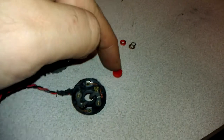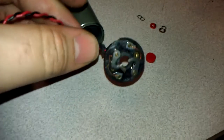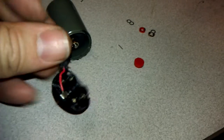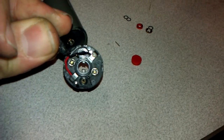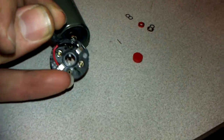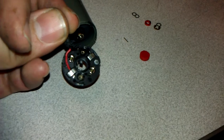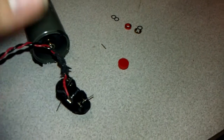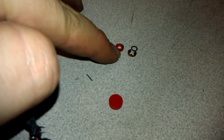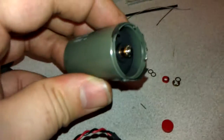Around the back, this red plug was pressed in after assembly. There is no bearing on the back of this motor, unlike a Mabuchi motor or whatever. There's a little access port where you can view what's going on when you're assembling it. I pinned the brushes back through the pinholes with a pair of resistor leads. From the front of the shaft, there are a couple of shims, an oil seal, and a little circlip. I suspect this is actually a sleeve bearing.